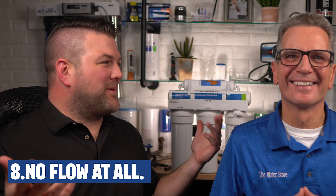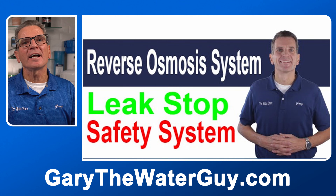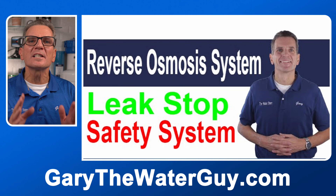I'm not sure what I did wrong, but now I'm getting no flow at all — what happened? If you just replaced your filters and emptied the tank, keep in mind it's going to take a few hours for the tank to fill. When folks first install their RO system, they're anxious to test the water but don't realize it takes a while for that tank to fill — often several hours to get up to pressure. But if the filters are new, all the supply and drain lines are open, and you still have no flow, check to see if you've got a leak stop that's been tripped. We've got a YouTube video that explains all about leak stops and the cartridge you have to replace once it's been tripped.